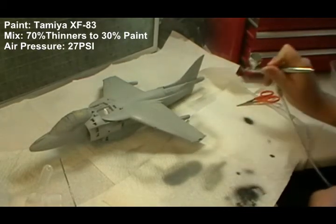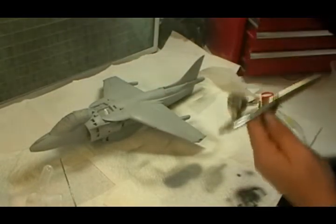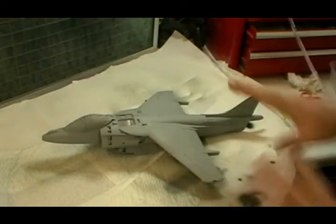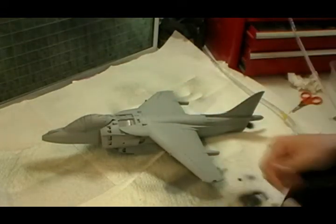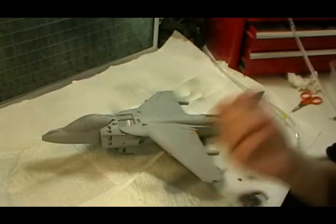Just go like that, and we can do the bottom in a moment when that's dry. So we'll just flick the extractor on, a bit foggy here. Just clear that. Right, that one's been dry now for about half an hour. Quite happy. It's quite rough to the touch, but that's something we can take care of in a moment. You can actually put down a wet coat and that'll gloss it up slightly, but we want it to be a nice dead flat finish.